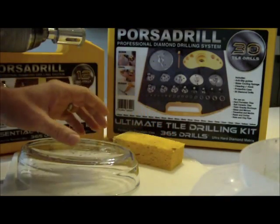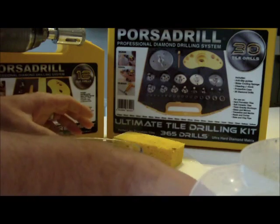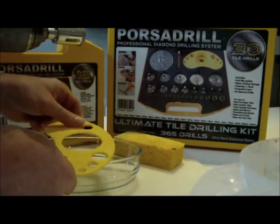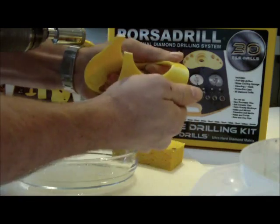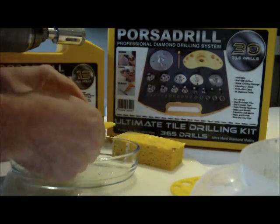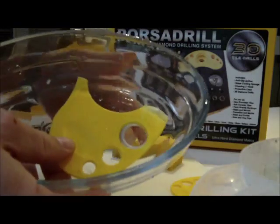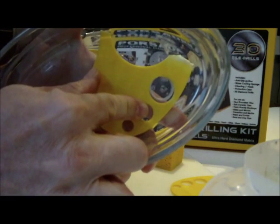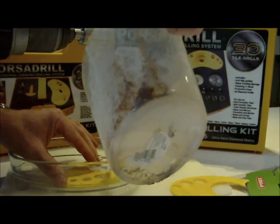It's a nice looking little hole. There is a bit of a cheat I'm going to show you — if you can go the other side and meet it in the middle, you'll get less blowout. The problem is I'm going to struggle to get the plate inside the vessel. So here's another trick: you can actually break the plates apart. I'm just snapping the plates apart — this gives you control. You can put the plate into the bowl, centre it up yourself, press down and lock on. So you can meet that centrally. Because it's a bowl, I can actually tip some water into it.